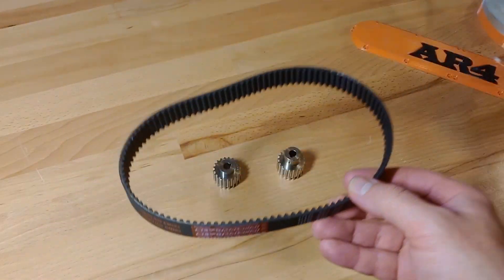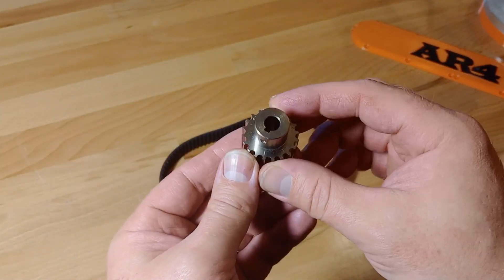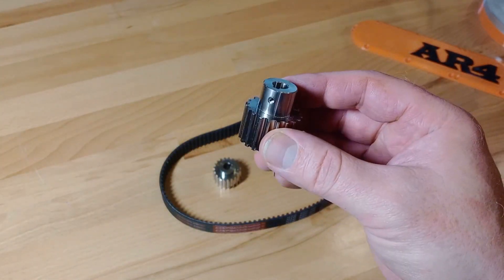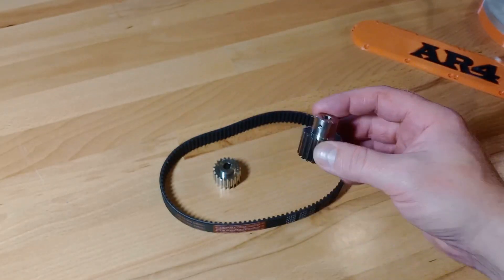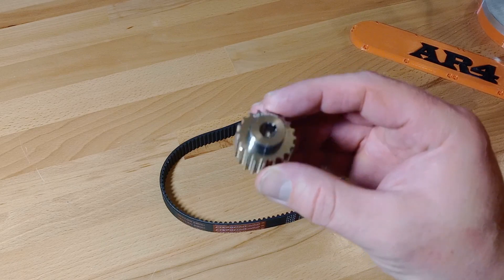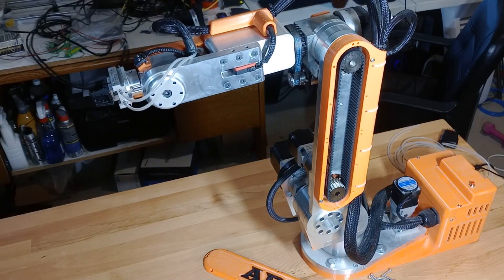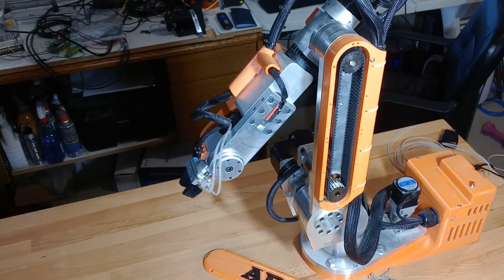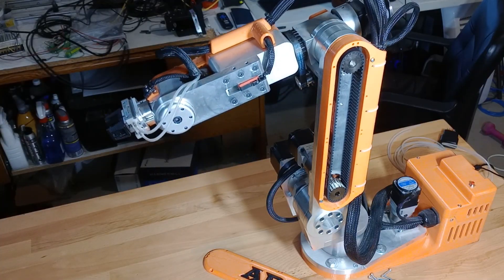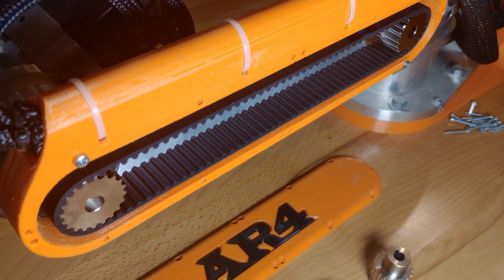This is kind of an upgrade that I've been wanting to do for a while. Previously, I had access to the low cost XL and L series belts and pulleys and given the goal has always been to keep the cost down, I stuck with those for quite a while. But I do have a good supply on these HTD belts and pulleys, so this shouldn't affect the price of the robot kits. The HTD belt has better engagement, less slip or backlash, and shouldn't require as much tension as the L series.